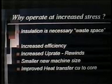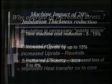So if we can reduce the insulation that we use within the system, we can end up with new machines that are smaller in size than the older machines would be. We can give increased uprates on rewind machines, and we can also reduce the copper loss in the machine. That results from having more copper in the slot due to the less insulation, and therefore we have higher efficiency. Also, a thinner insulation has an improved heat transfer from the copper to the core of the machine, so the new machines actually run a little bit cooler than the older designs.